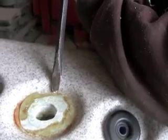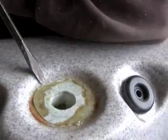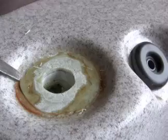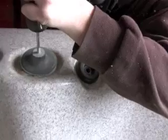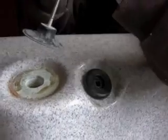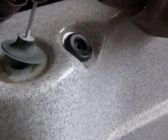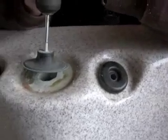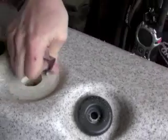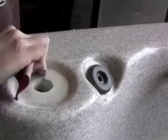You want to be very careful — just nice gentle little taps. After chipping away the large pieces with the screwdriver, this is a 3-inch grinding disc. For practical use, we just have it mounted onto a drill. We're going to sand down the excess plastic weld. Once you use the automated sander on the drill, get some fine sandpaper and clean up any of the deep scratches, especially on the acrylic, so it will be cosmetically appealing to the customer once we're finished.